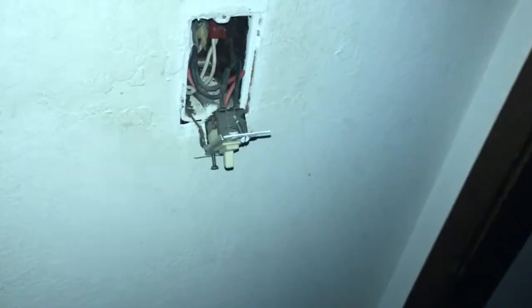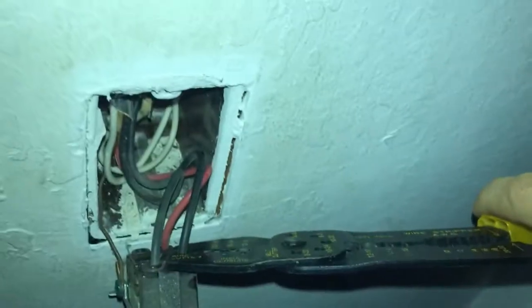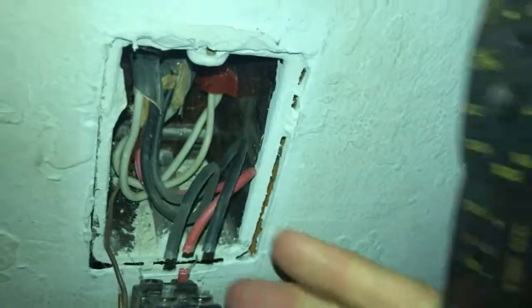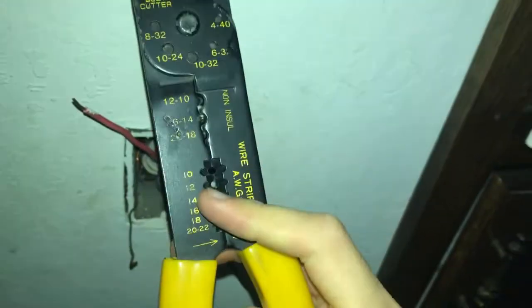The mystery you have to solve when diagnosing or wiring a three-way switch is which of your two black wires is your line wire and which is your traveler wire. With these old switches, the first thing I do is expose the actual copper on these wires. With older switches they can be very difficult to work with, so usually I just cut these wires since we have enough wire to work with. Then use a flathead screwdriver to unhook the ground wire and use the wire stripper to get clean new exposed copper on the ends. Do the exact same thing at the other side of the hallway.